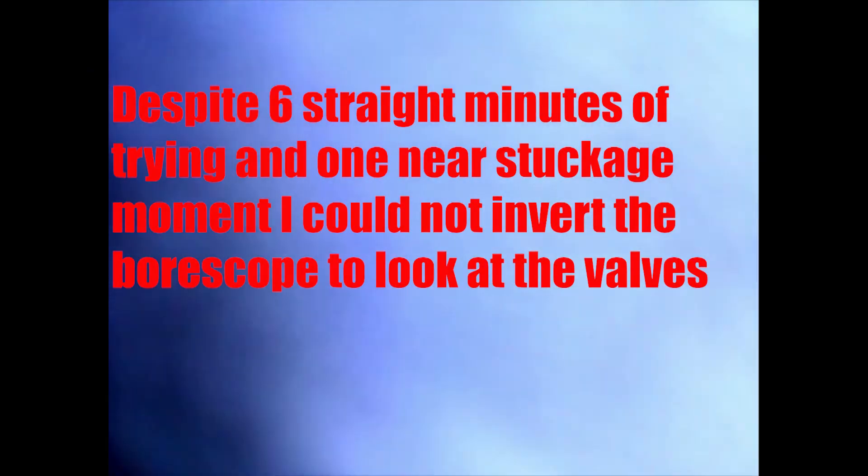Keep trying to go around. I think the piston is all the way down. Let's pull out a little bit and crank the cord to see what happens. Here's the piston coming in. One thing we can try is to push on the bore scope until it goes inverted and then try to look up at some of the valves. I could get the bore scope stuck in there and spend the rest of the day trying to get it out — let's try it anyway.